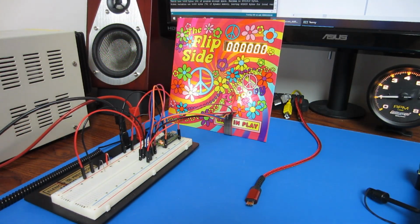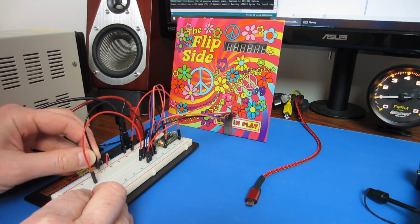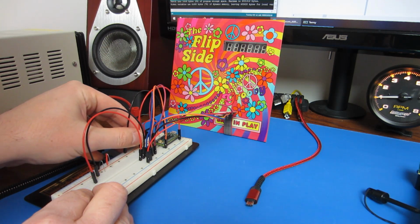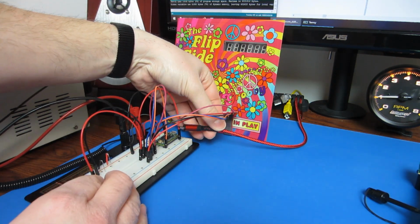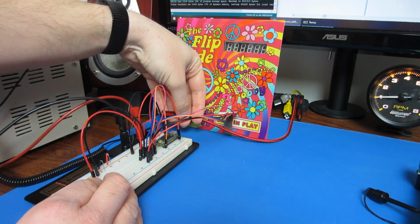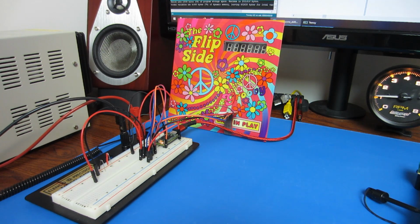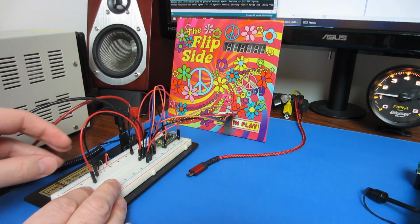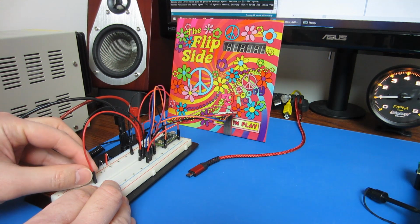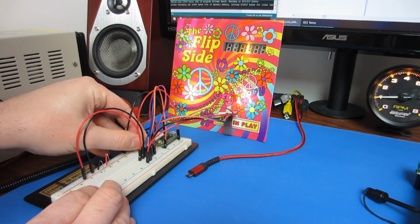And what's even cooler, let me show you. I'm going to pull power from the backbox and then from the Teensy. I'm going to reprogram it. You have to remember to pull power before you hook up USB to it. Let me just upload a new version. And then resume power to the backbox and resume power to the micro.